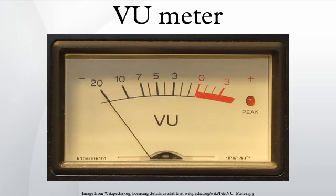The genius of the VU meter is that for most types of audio sources the system engineer can count on these peaks being within this range and can design the audio system with confidence. Good engineering practice is to always build in a little extra headroom to cover the strange conditions where an audio signal might exceed normal peak levels or the equipment operator fails to adjust the levels correctly.